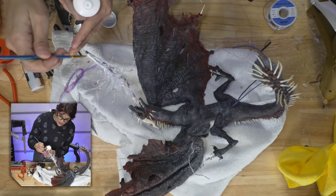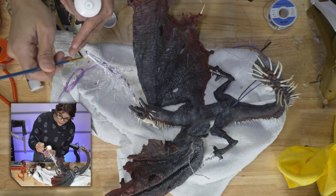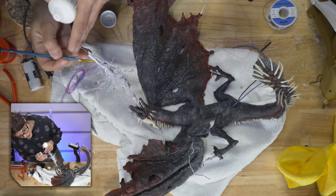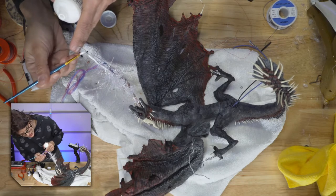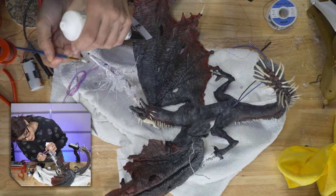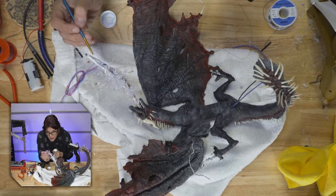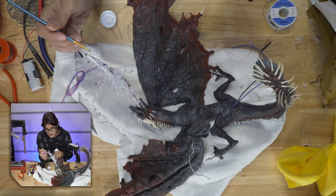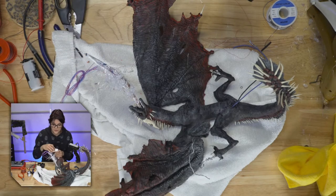Yeah, so the paint wasn't the greatest insulator. And I think it's because it really needs to dry before it can insulate. And I probably need a couple coats, which I only threw like a quick coat before we moved on. So hence why we're getting the repeated shorting problems. So hot glue should do the trick. Much thicker. Get to the bottom of this, like this. Do its thing. And there we go.